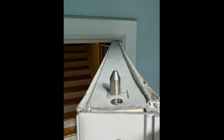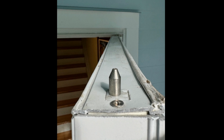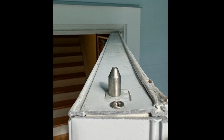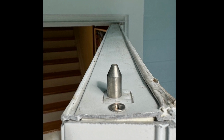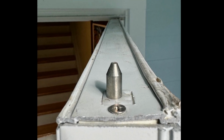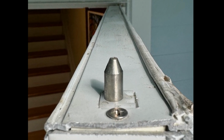This particular 3-point lock system locks at the deadbolt and 2 concealed rods. You will not be able to see the concealed rods because they are inside the aluminum door stile. When you lift up on the lever handle, it engages the concealed lock rods into the bottom sill threshold and also into the top frame header. These 2 locking rods along with the deadbolt is why it is called a 3-point lock.